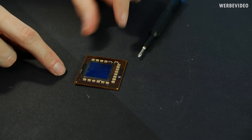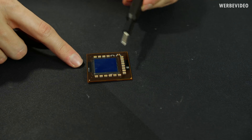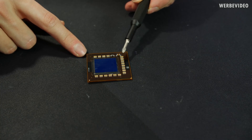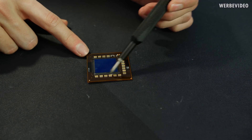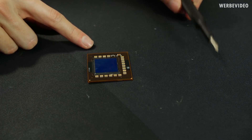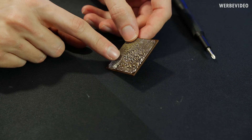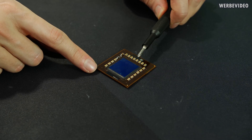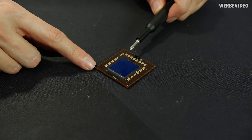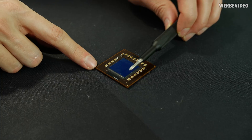Continuing with the main PCB which contains the CPU itself — backside has a lot of BGAs, some ruined parts. We will now remove the CPU die itself, so we will need a lot of temperature, like 350 to 400 degrees Celsius, because we have to get rid of the underfill. The underfill is the glue around the CPU die which also covers the complete underside. It protects the small BGAs underneath from getting loose over hundreds of temperature cycles, and it has a very high operating temperature.